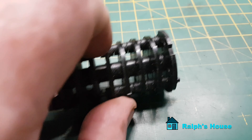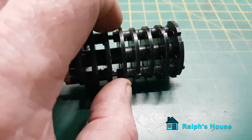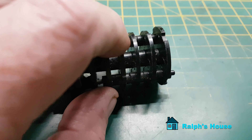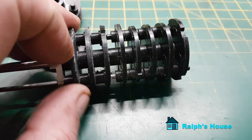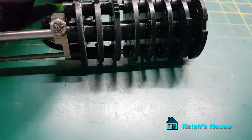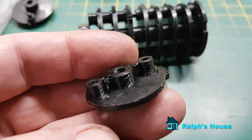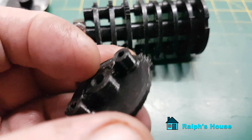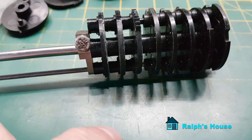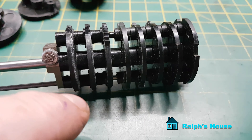Looking at the original camshaft - I was going to replicate the way they were put together, which is fine if you're putting it through a plastic moulding machine using nylon or something like that, as it's quite robust. But I didn't want to have to remake all of these cams since these work fine - there's nothing wrong with them. I decided to have flat-bottomed ones, and on the PETG ones I made the side posts all the same height so that the next cam sits on the back of that one. That's how these three sit together. If anybody wants the 3D STL files, I'll put them out or send them across if it'll help you.